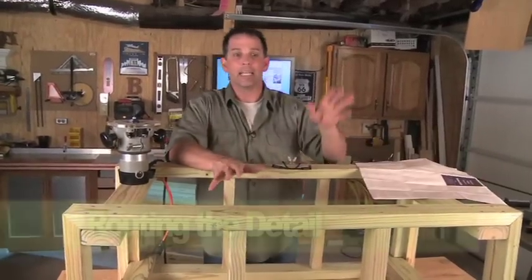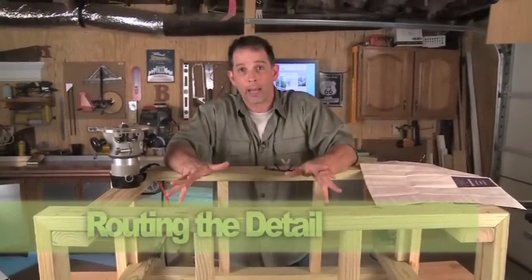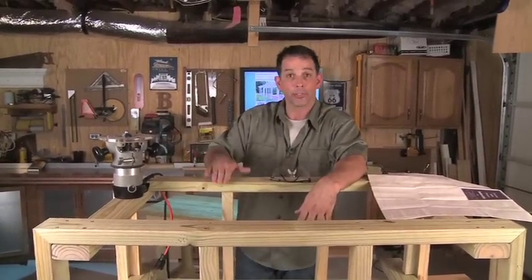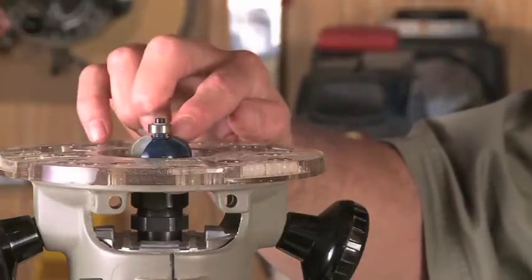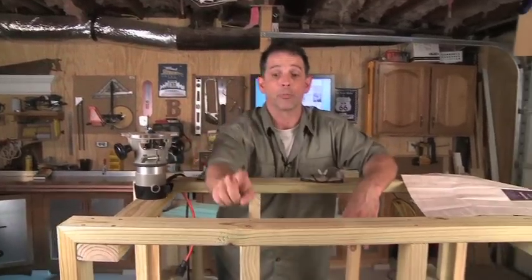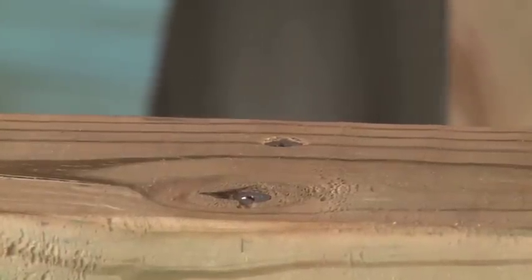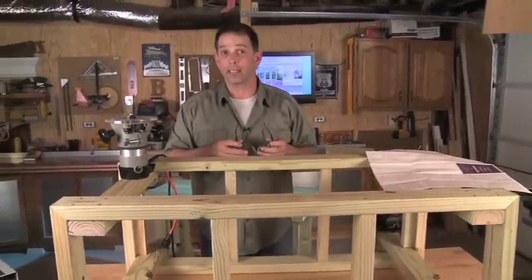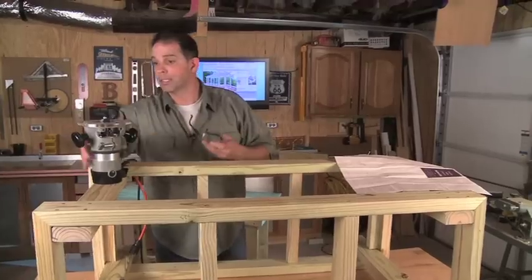All the bracing is in. I've got it laying on its side and the top is facing you. The next step is to put our router detail on — the bottom of the apron and the top of the skirt. We'll use a cove bit with a bearing on it. Make sure this bit doesn't come in contact with any screws — double check. If in doubt, take it out. Since this is going to kick up quite a bit of sawdust, I'll meet you outside with the table and the router.